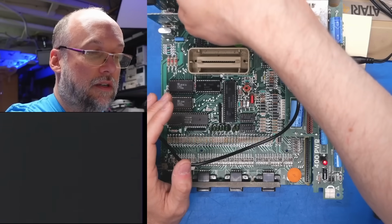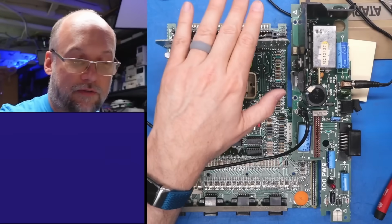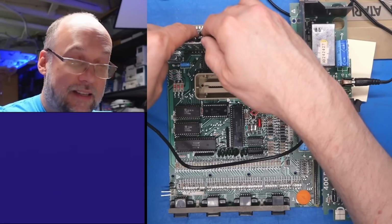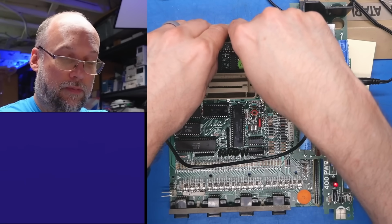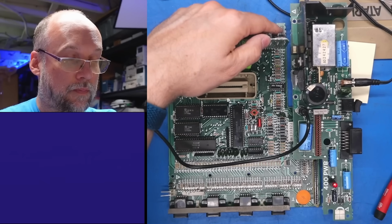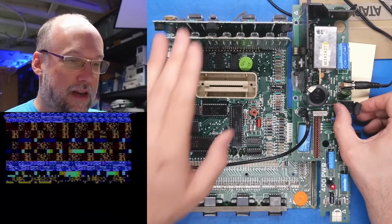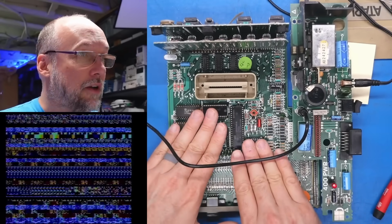And on the CPU card, everything feels perfect. What I'm going to do is pop out the CPU card and feel on the RAM card. Oh, interesting. Of course, there's no graphics. Without the CPU card in, you won't get anything on screen. So that's why it's just blue, but the power is on. RAM chips, nice and cool. Every single chip on this machine runs nice and cool. Okay, put the CPU card back in. Back to our wild static that we never had before. I'm just going to move things around, push on stuff while it's running.